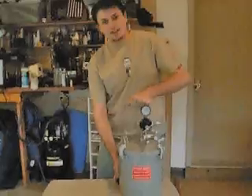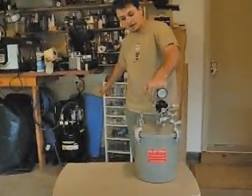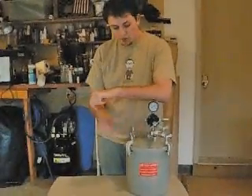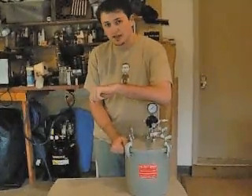There are two very important things you need while pressure casting. The first thing you need is a pressure pot like this, and the second thing you need is a compressor like what's behind me here. The theory behind pressure casting is that you use compressed air, force it into a chamber, and it crushes the bubbles out of the mold you're trying to make.